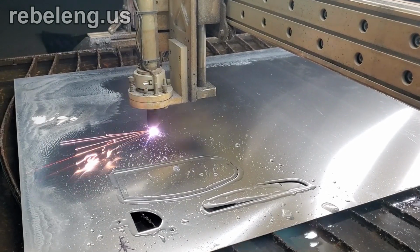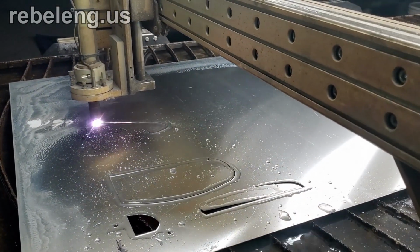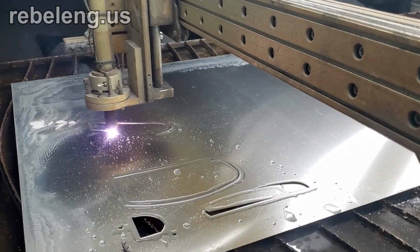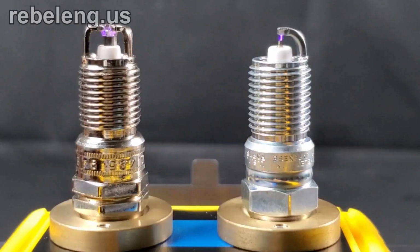When there is a metal workpiece within reach of the torch, the arc latches onto the metal. The reason this happens is that the current through the torch is limited by a resistor, making the metal workpiece a more attractive ground. Originally, this was done with a high-frequency pulse, but more recently, this method has become less popular. You can think of high frequency like the energy used to fire a spark plug used to ionize the pressure gas going through the nozzle. All plasma cutting systems used high frequency starting until Hypertherm developed the blowback system starting in the late 1980s.